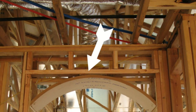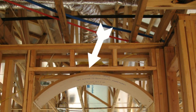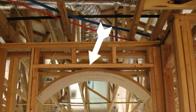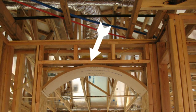Now this isn't going to be the case all the time. Every once in a while you're going to have shear walls and things like that, so it isn't like you can just put a 2x4 anywhere inside the house. But if you do run into a situation where you have a non-bearing wall and you feel comfortable putting it in, then by all means go ahead.